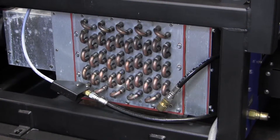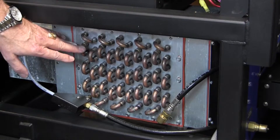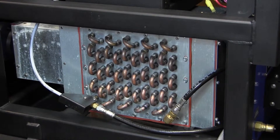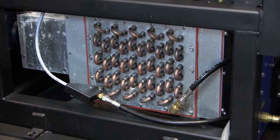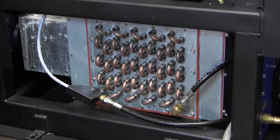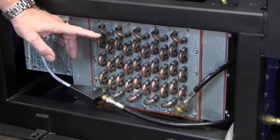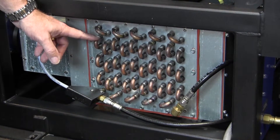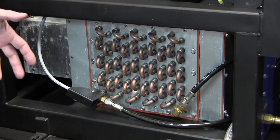The last maintenance component I'd like to talk about is the box heat exchanger. Because we're drawing in air across a radiator-type grill down below, carpet fibers, hair, and soap suds built up in the waste tank can be drawn through and deposited on the screens. We recommend pulling this out and cleaning it at least every thousand hours — it's very important for the breathability of the machine to avoid any clogs.